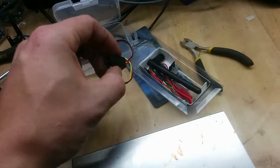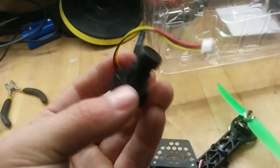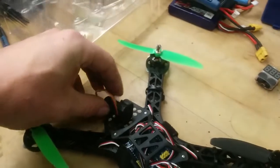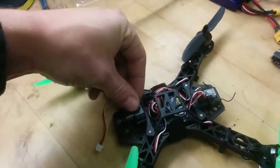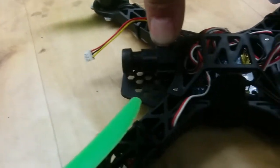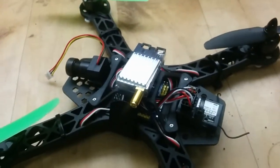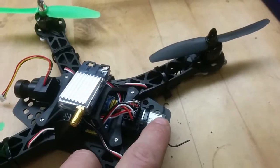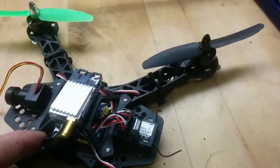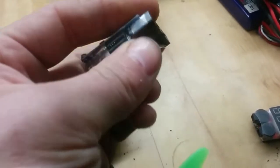There are two other alternatives - a medium one and a really, really small one. This medium one here is 11 grams - that's nice. It's the same kind of camera as the Fat Shark uses, but this one is actually a fake, though it produces fairly good image. Mounting it here it would look really, really nice, and it would be kind of protected because it doesn't stick out in the front. The big challenge would be mounting the transmitter - most likely I will be removing the receiver and swapping spots, because the receiver is small. I might even be able to squeeze it in somewhere and move the receiver to the back end. I'll be de-soldering to get cables on there directly to save weight.